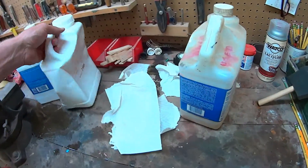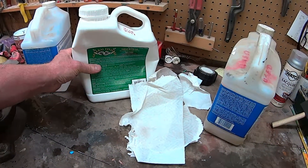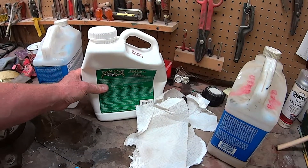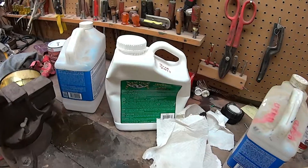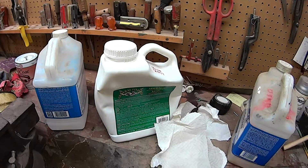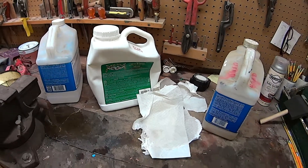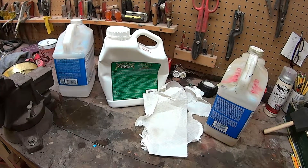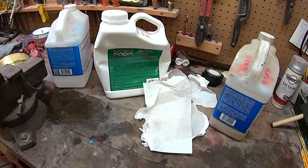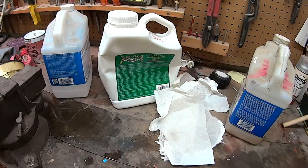While we're talking about armor seal, I'll talk about my technique a little bit. I always squeeze the can to get as much of the oxygen out of there as well. I usually get about 12 months shelf life. After that, it starts getting a little hazy and gummy. Sometimes I've been out to 18 months and been able to use it, or I use it on projects I don't care about as much or just use it as a sanding sealer. I go through a gallon of this usually in 12 months' time no matter what I'm doing.